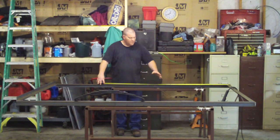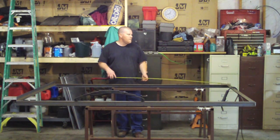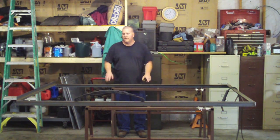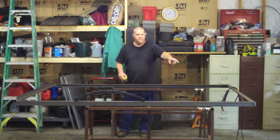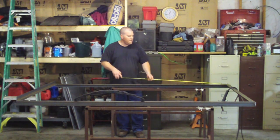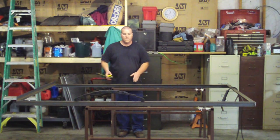If you have the axle more in the center and you don't have enough tongue weight, this thing is going to be all over the road. It's going to fish tail on you. I've always been of the opinion that you're better off having more tongue weight than not. My application is I'm going to center my big welder — it's a 1,500 pound industrial Miller welder — right over the axle. I'll have room for tools and torches up front plus hitch weight. You don't want too much, otherwise it's all on your suspension. So in this application for a 5x8 trailer, I'm going 58 inches to center of axle, and then we're going to start worrying about hanger brackets.